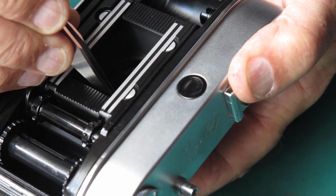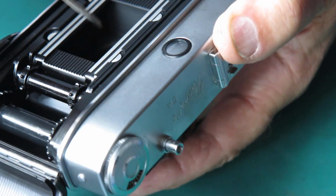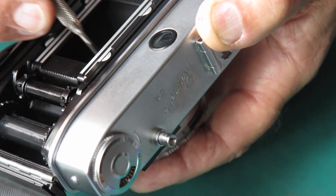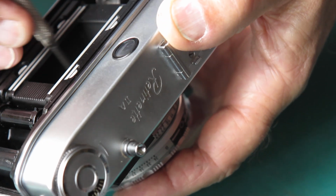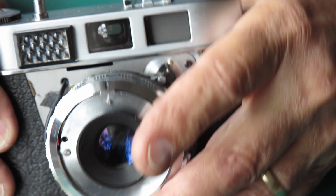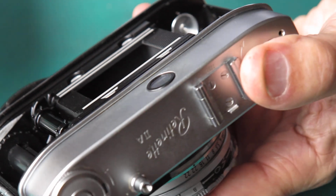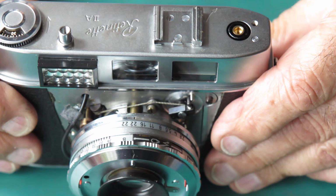But I'll put my retaining ring in place. And the retaining rings on these don't seep down a long way. They're a little bit suspicious looking when you get them on because you don't get many turns. See if I can get it started. It feels good. I'll just check my shim, make sure that that's seated correctly. Yeah, the shutter is fixed back to its spot there. I'll tighten this up. I don't need to go mad tightening it up.